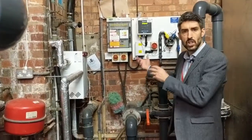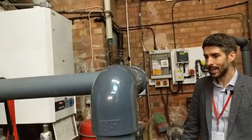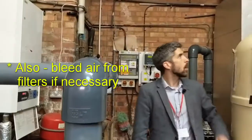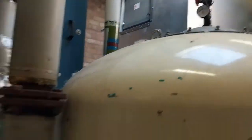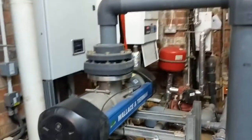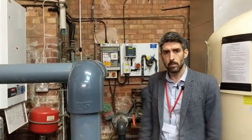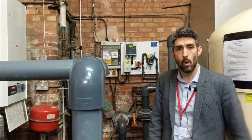It might take a couple of minutes for that to reset. Before you leave the plant room, do a quick check that everything is back as it should be: pressure on both filters, all valves back in the right position, chemical dosing system back on. And that's the backwash of filter number one complete.